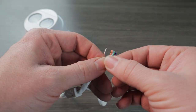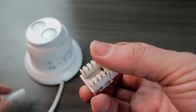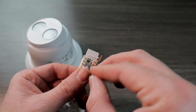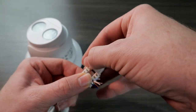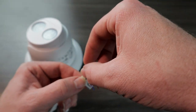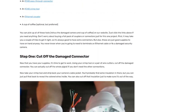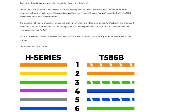Now let's get these wires laid out in our keystone jack. First, I'm going to show you how to do this on the standard traditional keystone jack that requires a punch down tool. You'll take your ethernet cable and lay it there in the center of the jack, and we are going to lay each of these eight wires in one of these terminals. You can see on the sides there, we do have some color coding, and we're going to be following the B standard. If you're using one of these keystone jacks with an H series or an R series camera, be sure to follow the number instead of the color. To see which color corresponds to the number, go ahead and check out our blog post in the description below.